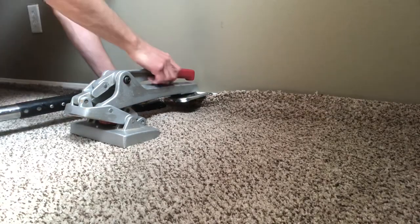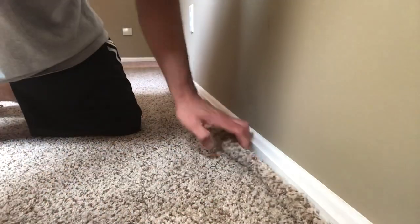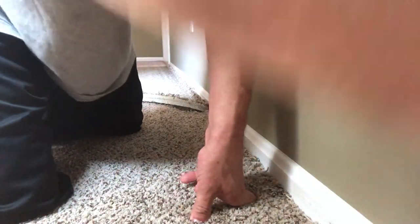Any other case you can easily add on $100 to $150, because there was a room and a hallway that we had tightened up on this deal. We're gonna break this down in a couple different segments so you know how to do repairs, but that's all there was to it. Locked the crab stretcher on the tack strip, pulled all that slack across the room — you see me kick it up while I was running my mouth there. Locked it onto the tack strip, now we're taking our blade, just trimming it right in, tucking it to the wall, and we are good to go.